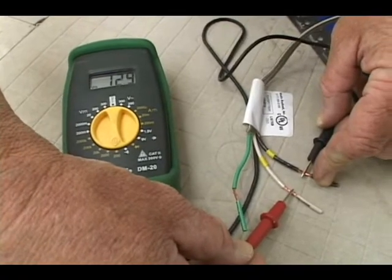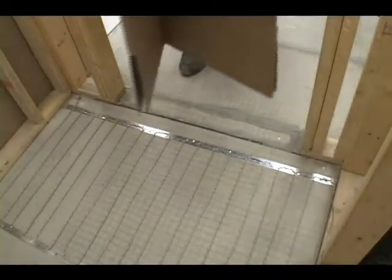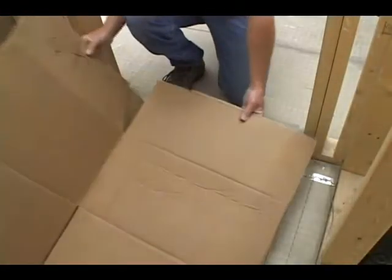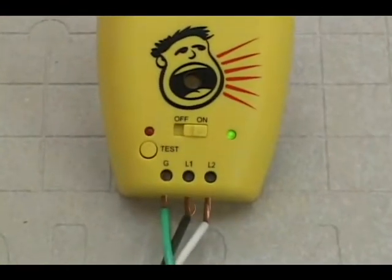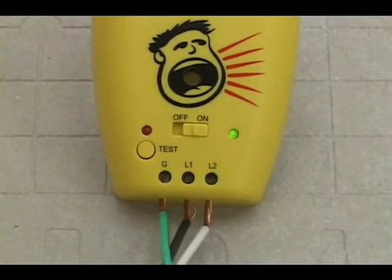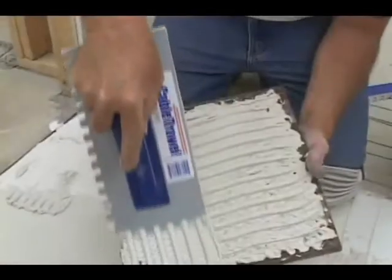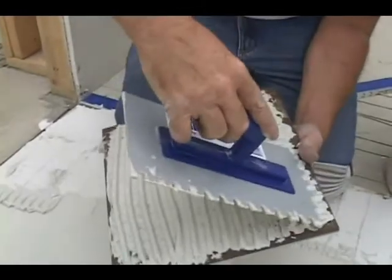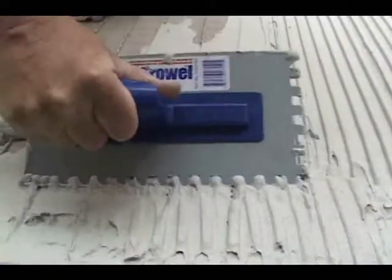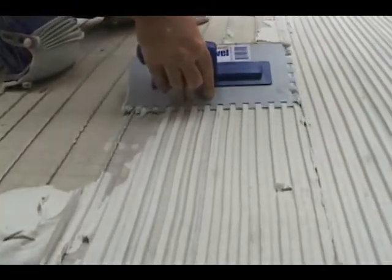When you are finished, take more resistance readings. Take several pictures before applying masonry. Protect your work with cardboard if you don't apply a finished floor right away. Before applying mortar, make sure your loudmouth monitor is properly attached and working. Radiant floors can require more thinset than cold floors, so plan accordingly. We recommend the plastic cable trowel — it's lightweight, easy to use, cleans easily, and is much less likely to damage your heating elements. It's available through your warm wire distributor.